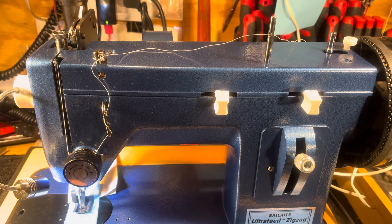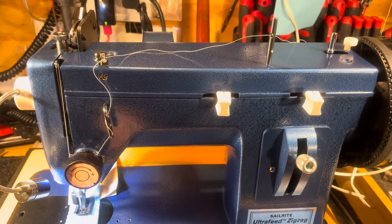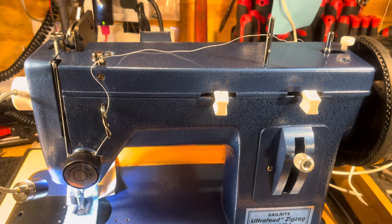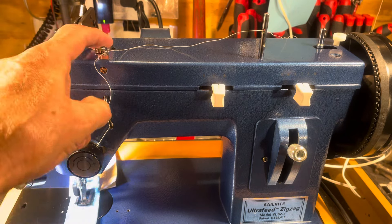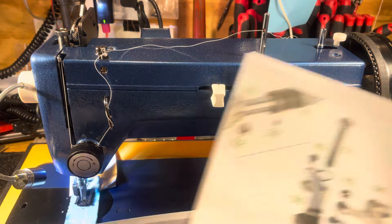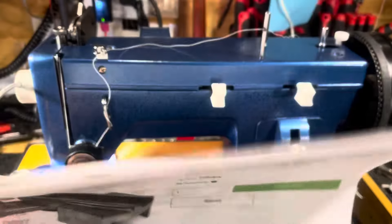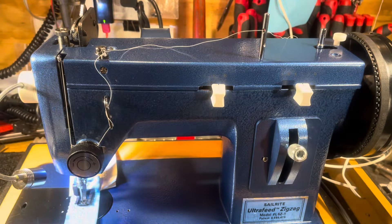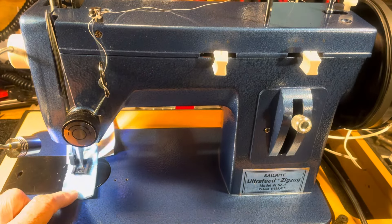If you've got a new one, I wouldn't hesitate to recommend it. I've been recommending Sailrites for a long time and I'm going to continue to do that — with the caveat that on the zigzag models, straight-stitch machines don't have that problem, but with the zigzag, know that situation exists. Be aware of it, and be ready to do a workaround. Or when buying used, take the two screws off the top and check. Ask: does it have the new improved needle displacement regulator assembly? If you ask a smart question like that, they'll say yep, you're all set, and you can buy with confidence knowing it won't break and will zigzag like it's supposed to.